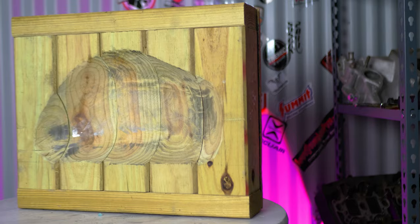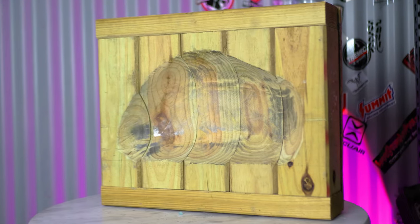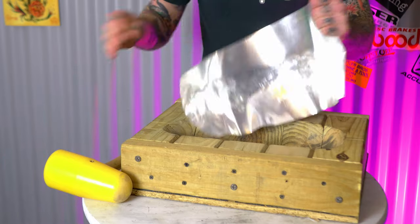The other common form of metal shaping is stump shrinking or stump forming. This is a shrinking stump I made a couple years ago — honestly not a particularly good one but it works. It's based off the design that Ray Chaline at Pro Shaper Sheet Metal uses, made from 4x4s or easily available lumber rather than finding a hardwood stump. We will be doing a dedicated video to making a shrinking stump in the old-fashioned actual-stump fashion in the not too distant future. Despite this stump not being ideal it can still work for what we're talking about, so let's use it to shrink some sheet metal.